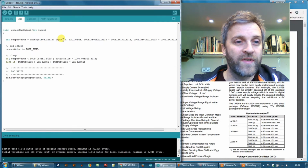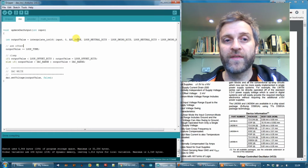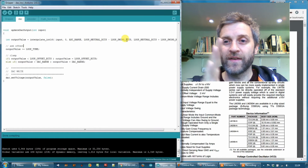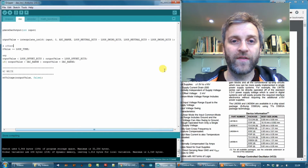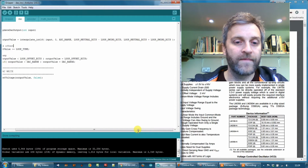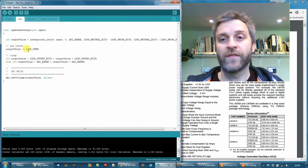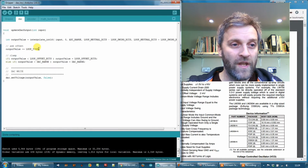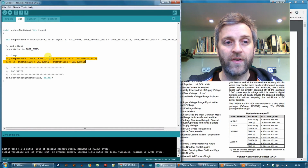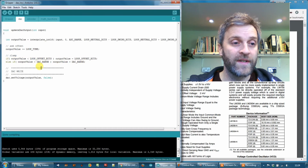And then I'm using that to scale the potentiometer input from its full range of 0 to 1023, and I'm scaling that to that 12,000 microamps less 1,000 and plus 1,000. And those are defined here. So there's the out low and the out high. So what I get out of that routine should be the value of the DAC to send according to the scale that I've required. I also add the loop tune there, which is obviously set at 0 at the moment, so that has no effect. I then just clamp the output to make sure we're not going above or beyond the limits, so not above 20,000 microamps or below 4,000 microamps, and then I write it to the DAC.